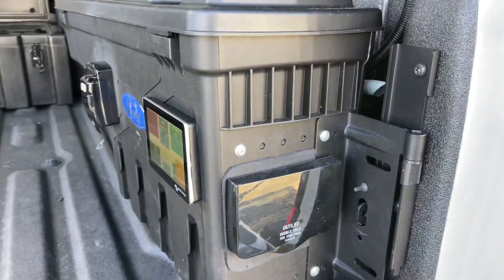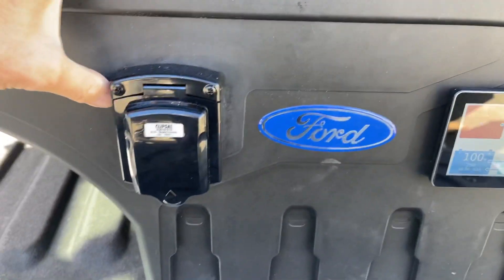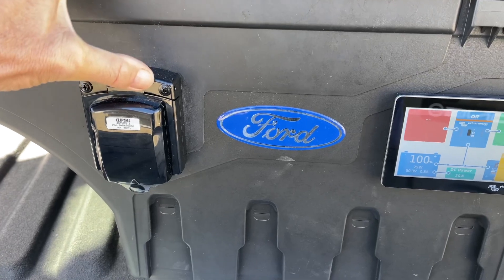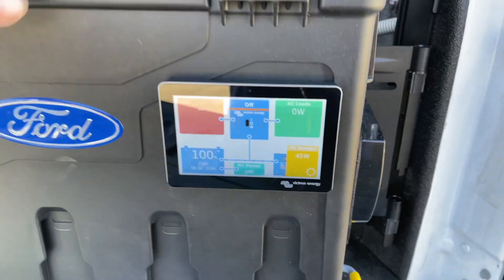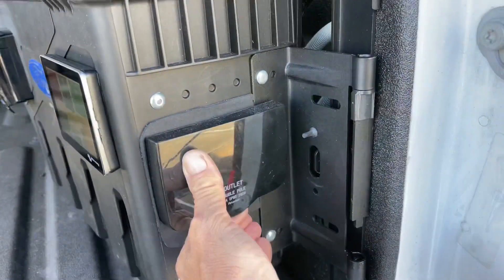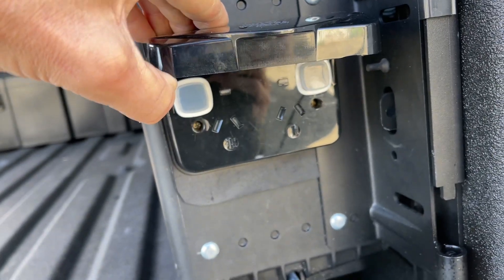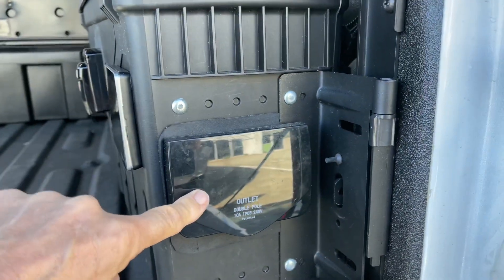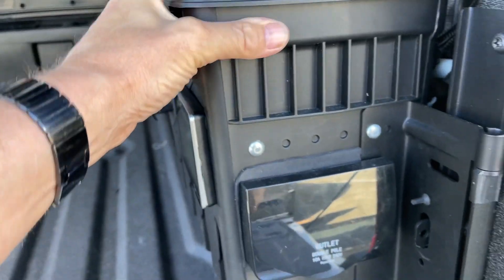At the back here is our control interface. Just to recap: this is our actual power in. So if you're at a powered site and you want to charge these batteries, they'll charge at 1.7 kilowatts — super, super fast. Then we've got the display here, and our power outlet here. That's a 10-amp outlet, but it can go out to the caravan to run 2.4 kilowatts coming out of it, and we can put a 15-amp there as well. So inside here is all 240V and the HDMI from the display — no low voltage in there, fully compliant.